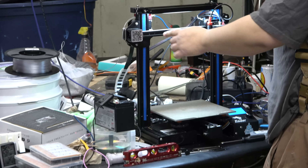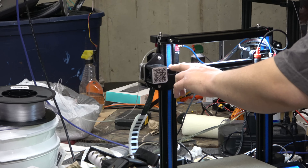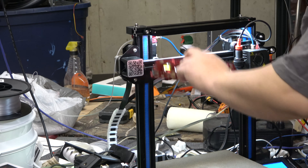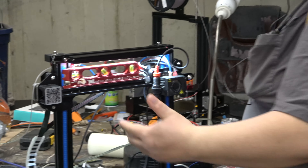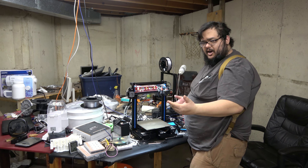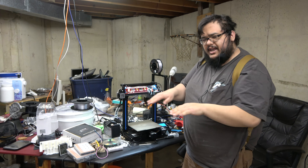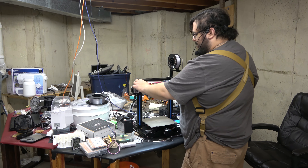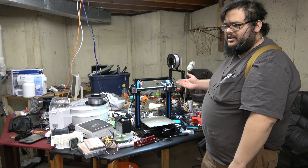The first thing has to do with this small aluminum extrusion that makes up your X-axis gantry. Unfortunately, a lot of times, this piece of metal is just simply not flat. If you take anything that is a known flat surface — maybe a glass table that's typically very flat, or a carpenter's square — and you place it on your X-axis, if it is not completely 180 degrees flat, you may never get the left side and right side lined up, and depending on how it's bent, it may cause the situation where the right side is higher than the left.